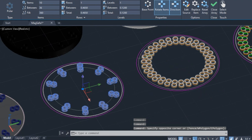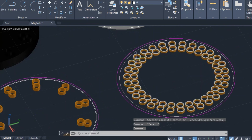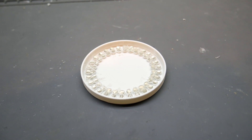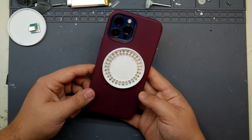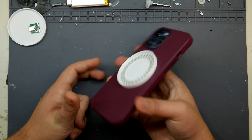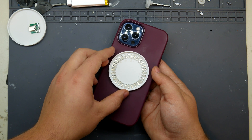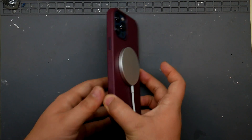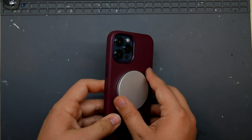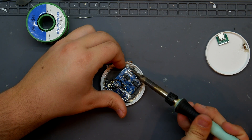In this design, I went back to my 3D model and adjusted the array — instead of 10 items I now have 30. So instead of 10 pairs or 20 magnets total, I now have 30 pairs, or 60 magnets total. After mounting all the magnets and placing the mount back on my phone, it was again incredibly satisfying — even better than before. In the previous version the mount held, but it was nowhere near the strength of the original Apple MagSafe charger. But in this version, the strength is equal to if not stronger than the original. I then taped all the components together onto the mount just to see if it stays on the phone — and sure enough, I had no problems with it staying on. This is definitely the best route to go.